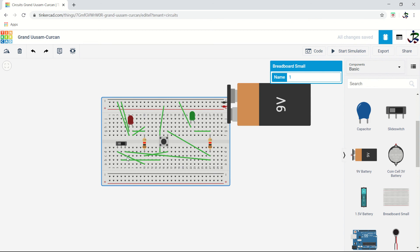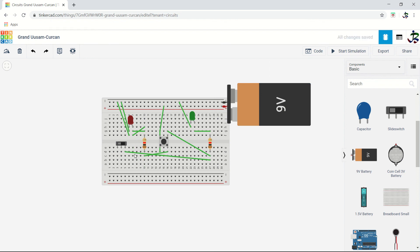Let's stop and find the mistake. I'm doing this mistake intentionally so you can understand how to troubleshoot a circuit. Both LEDs are getting on without switching anything — there is clearly some mistake. I will delete all the lines connected to the switch so we can understand more clearly. The positive and negative are connected twice — that is not needed.